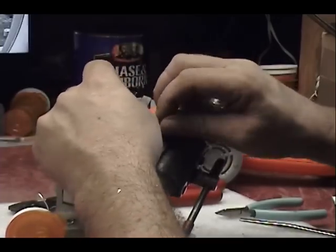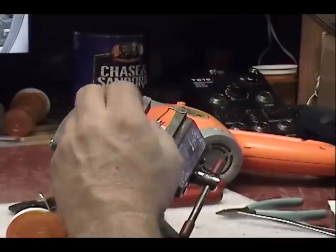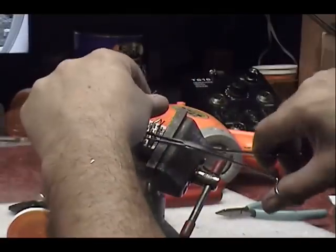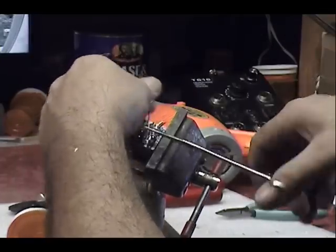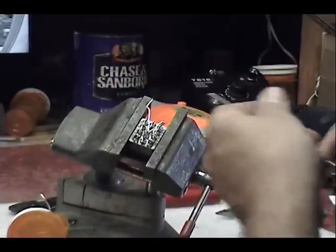This jumper wire I use is the silver plated wire from the inside of a Wilson silver load antenna. When they go bad, I pull that wire out. It makes great jumpers. They solder real easy because they're plated with silver.